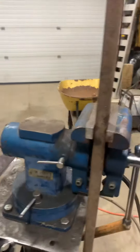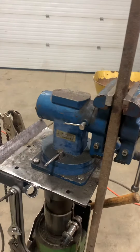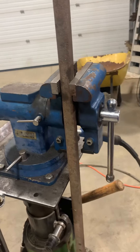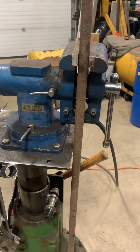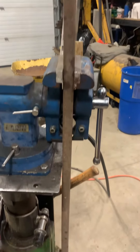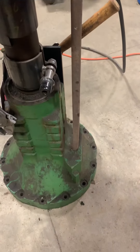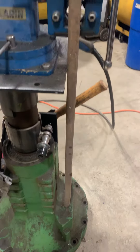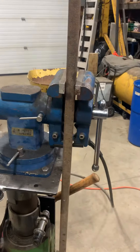We have an all-direction vise with pipe fittings. It's a cheap offshore-made vise, but it does what we need, and when you break it you replace it for not a lot of money. The line of the jaws transfers all the way down to a flat spot in the casting, so any shaft hitting or dropping doesn't go onto the concrete floor or break it.